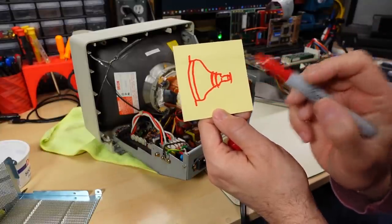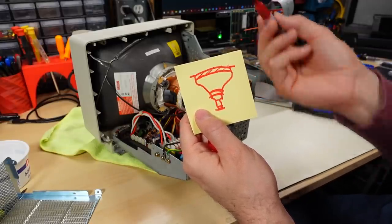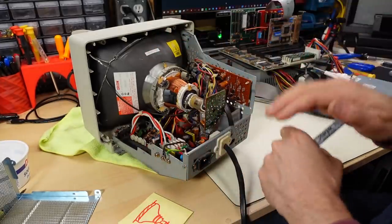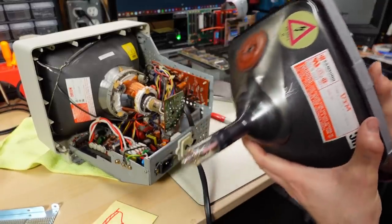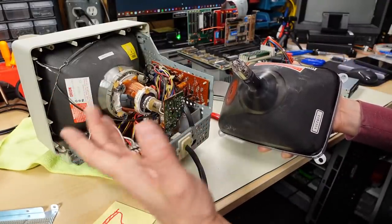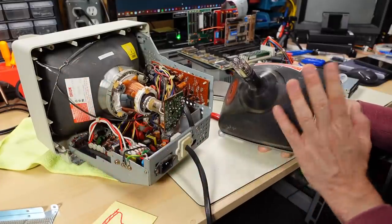Here's a crude diagram of the CRT that's in here. The thing with the crosshatch is the implosion band on every CRT, and the mounting ears are usually welded onto it — they can be at the front, back, or use a clamping mechanism. This CRT uses mounting tabs near the front of the glass. Comparing it to a CRT from a Macintosh, which has tabs also towards the front, I think there's a good chance these two CRTs are interchangeable. So if this one is worn out, I can take one out of a Mac with a destroyed board and swap it in.